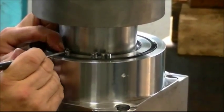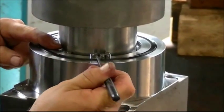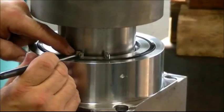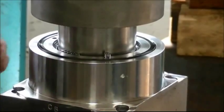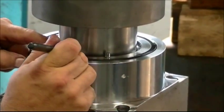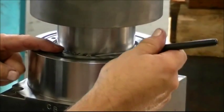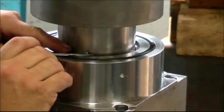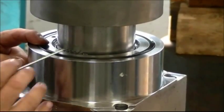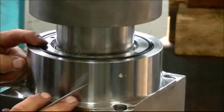This next procedure is bearing installation. These are bearing pins with a circular side on one side and a flat or round side that goes around the perimeter of the bearing. Greg uses a small pick to drop the bearings in side by side — the circular part must stand up and should clear the housing as it drops into each groove. The bearings will stick up just slightly above the housing, which is expected. If one rolls, a pick can easily pull it up and turn it back into position. The bearing count must be correct on both sides of the manifold; there will be extra bearings in the kit.